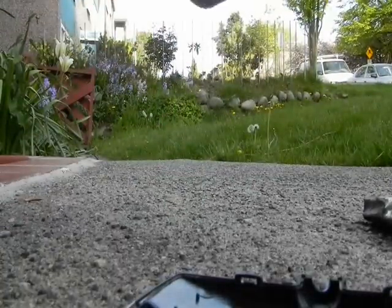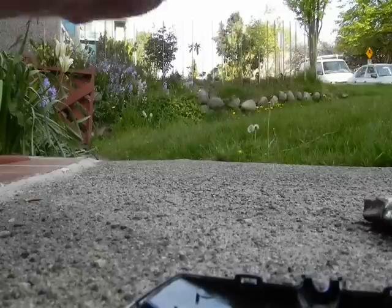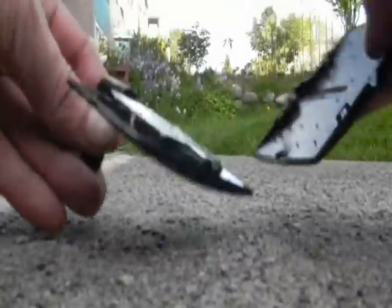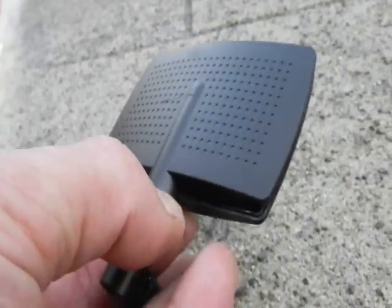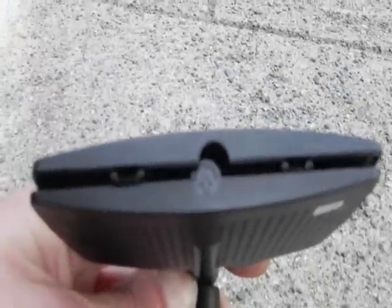So if you're using your FrSky 7dB antenna on your radio, unfortunately you're probably using it incorrectly. The correct position won't fit on top because of that defect in the design. You're going to have to cut off that little knob and glue it back on so that you can point it outwards in the right direction, with that small arrow pointing out.